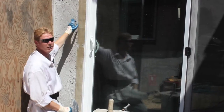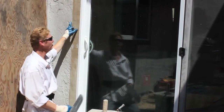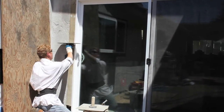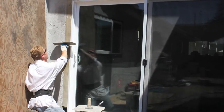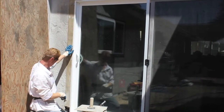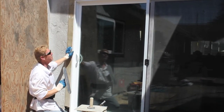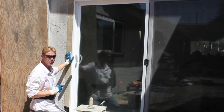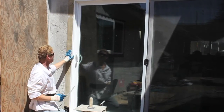It's a smooth patch and here we have a skip trowel finish. This patch is heavier and lighter in some areas — put a trowel on it and you can see it kind of balance. A fella asked me, should we remove it? The problem is if you remove this patch you'll have to repaper it and rewire it because you'll compromise the membrane.